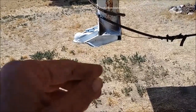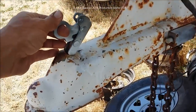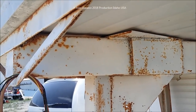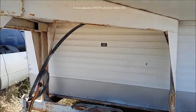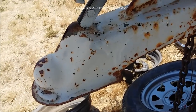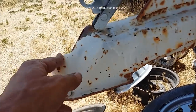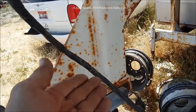If anybody thinks that that is not an effective outcome of a hitch, here, look, I'll show you one that's been built in the 60s. All right, so back in the 1960s, I think 1961 or '62, this thing was built for this trailer that's sitting here. It was built by Pilot Industries in Utah, and they started out with horse trailer frames. So they had a regular agricultural frame, and then they built fifth wheels on it. In this case, it uses what they had available at the time for a hitch, and not the best in the world strength-wise, because the metal here isn't anywhere near as thick as the one you just saw that I just walked away from, and it's just got a little bit of quarter plate running up a lot smaller tube, and it too is a 6,000 pound trailer.